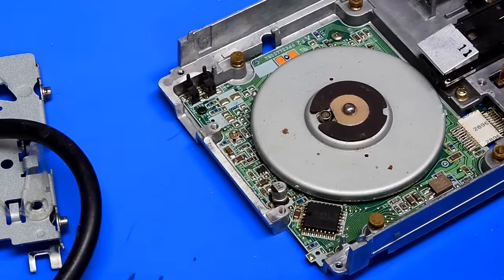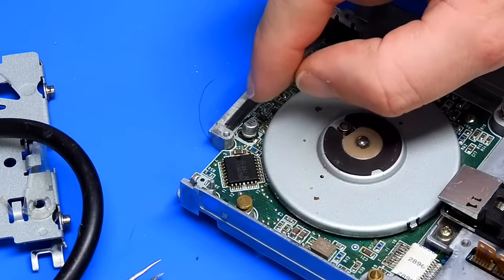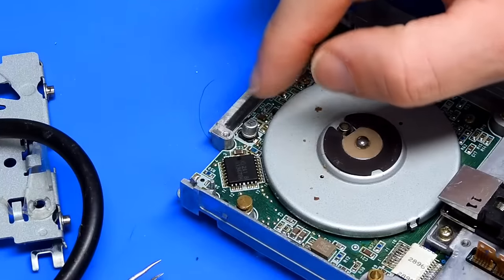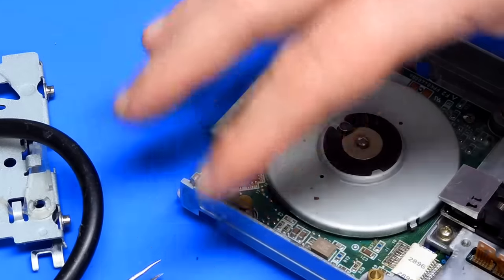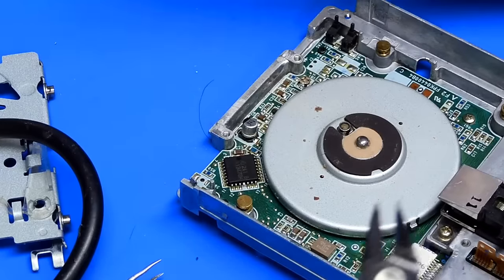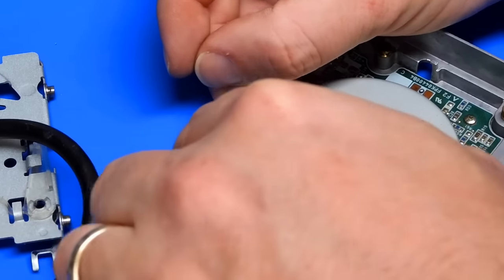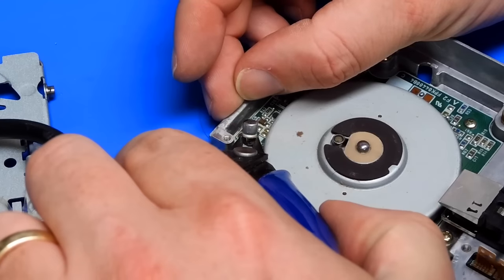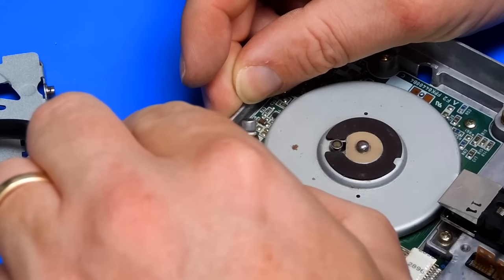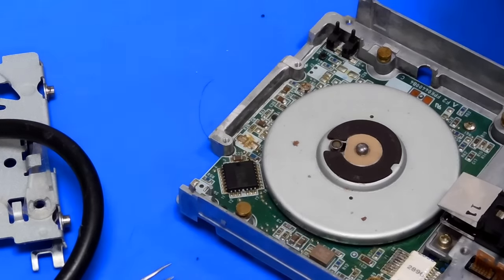Yeah, it is. I'm going to do something here that is rather frowned upon. Let's cut it off. You can see the old cap has swollen quite a bit with the heat. It was about to explode on me. But the reason that it's not melting the solder there is probably because of this big aluminium body that is sucking away all the heat. So let's cut it off. I'm trying to go in here and cut the legs of the capacitor. That's one cut. That's it off. Yeah, not really recommended, but in this case it worked okay.